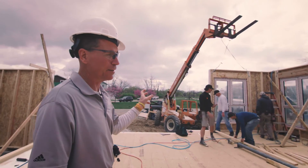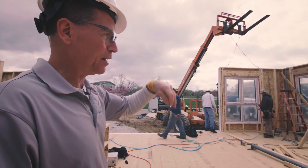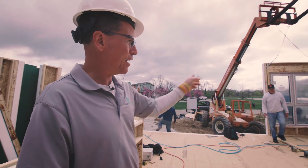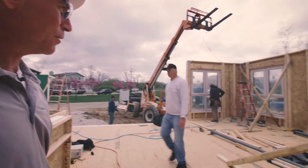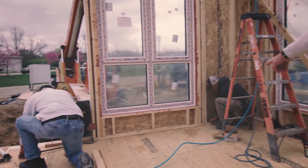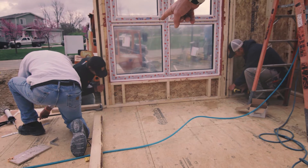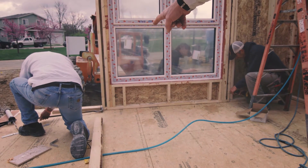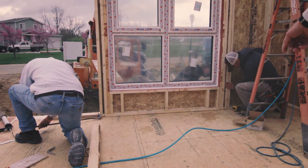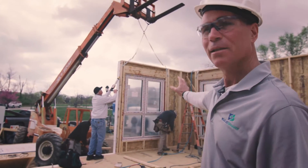This combination of panel units helps the designer optimize and plug the component systems into whatever their design and floor plan may be. You can see how the whole array connects to make this floor footprint work out. They're joining the two panels together — they've screwed a small scab block into the subfloor, which allows them to pry and slide the panel easily into place, then fix the two panels together with a structural screw.